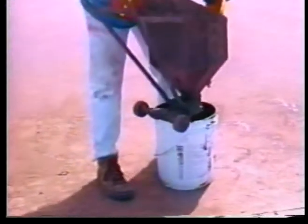Now it's time for cleanup. TA-500 dries on the surface in approximately 5 to 10 minutes in warm weather, forming a skin that protects the wire from rain and traffic. Cure time will depend greatly on the width and depth of the slots filled and weather conditions. During the curing process, TA-500 may feel soft to the touch for several days after application without affecting the final results. The Band-Aid or excess sealant on the roadway will wear away within 2 to 3 months.